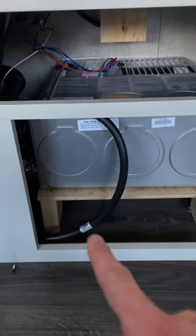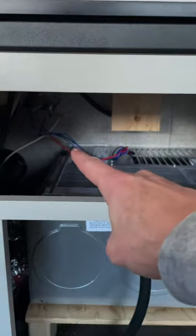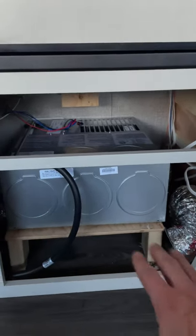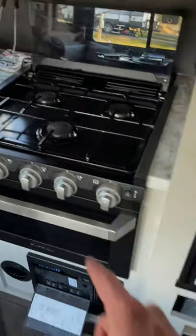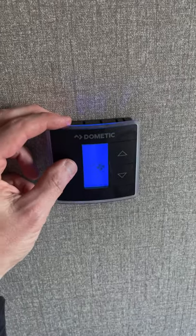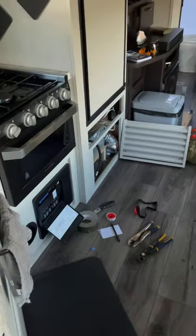Okay, I got it back in there. I hooked up the propane line, got that back up, and the wiring is hooked back up. I'm leaving the vents unhooked for now — you have to hook them up while it's in there anyway. I didn't put the brackets back on yet. I just want to kick this on and see. I ran a burner on the stove to make sure propane was coming through and let it run for a minute to blow any air bubbles out of the line. I've got the thermostat set pretty high so it'll definitely come on.